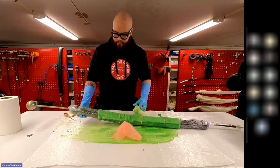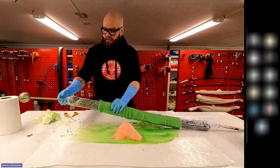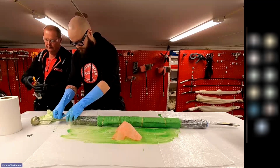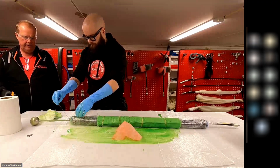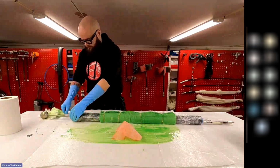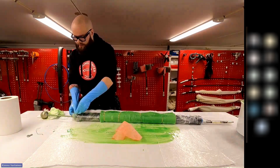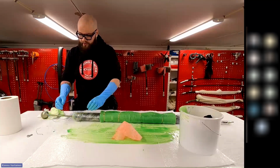Like so. And then I have the paper strings which I tie to the front of the packer, just to hold the patch piece in its place. There are many ways to do this, and the paper string will melt eventually. What is left in the pipe when the patch has been cured, they will melt away.